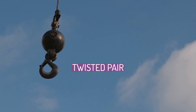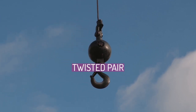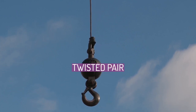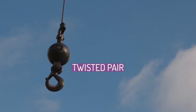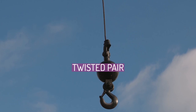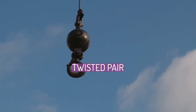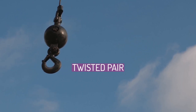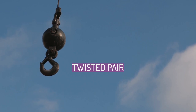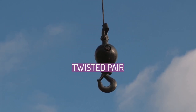Twisted Pair TP Conductor, sometimes called by the trade names T2 or VR, has two subconductors twisted — usually with a left hand lay — about one another, generally with a lay length of approximately 3 metres (9 feet). The conductor cross section of the TP is a rotating figure 8. The subconductors can be any type of standard ACSR conductor but need to match one another to provide mechanical balance. The major advantages of TP Conductor include reduced propensity for aeolian galloping. During an ice storm, the twisted conductor profile prevents a uniform aerofoil shape from forming, which inhibits the initiation of the galloping motion.